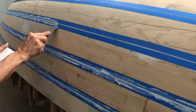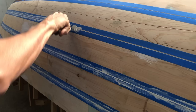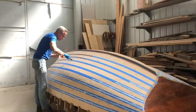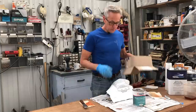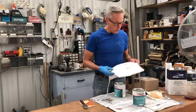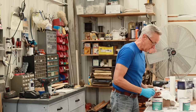I mentioned earlier that I had done the starboard side yesterday. I learned that the white compound went into the seam really easily — because of its soft, pliable nature, it went in really easily and it's also really easy to tool it off with that spoon. But I did discover that the brown was a little harder to get in there because of its stiffness. So what I learned to do was to warm up the brown. I simply took a heating pad and put it over the can, then put a box over the top to hold it on there. By doing that, the brown stayed really nice and pliable.